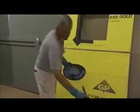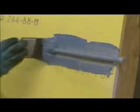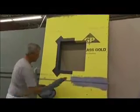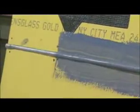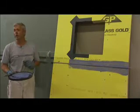One guy's always got a brush in his hand. A lot of times with the 5-gallon, I'll just use the lid to hold the material so I'm not going back continuously. Once you start, you just start applying the materials — just put a good liberal coat over the entire surface. You'll notice that when it goes on, it's light blue in color, but as it dries — you can see where we put some material on the top just before you came down — it dries to a black color. The key is on your first coat: lay the mesh in and then coat it again. Once it turns black, you've got to coat it one more time. Then you're done.